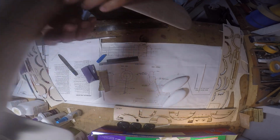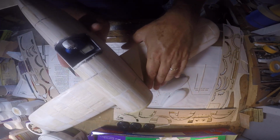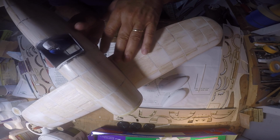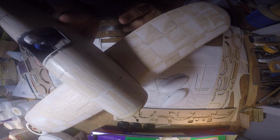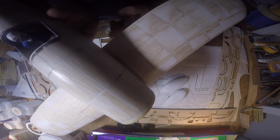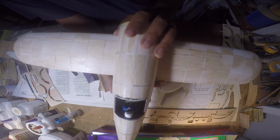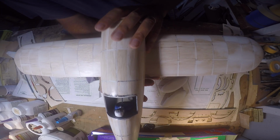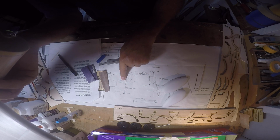and prepped for paint, we're going to have to do the wing fillet, and that's the fairing that joins the wing to the fuselage, and then it extends back here with a triangular kind of a piece that rounds the wing, blends it this way over, and then back into the fuselage. So this wing had a pretty decent sized fillet on it, nothing like the GBZ or R1, but it does have a pretty serious fillet there. So that'll have to be replicated. And then once all of that is done, then I can start piecing together actually the landing gear legs and get these parts made.